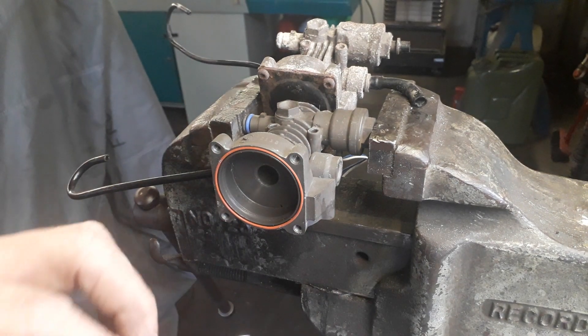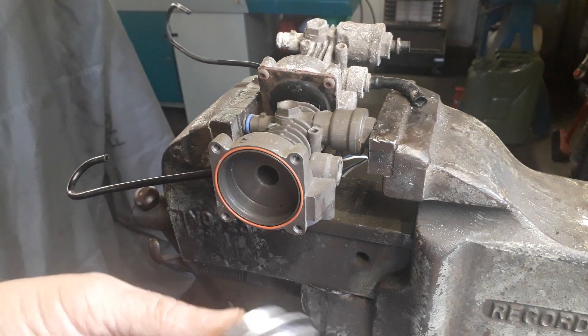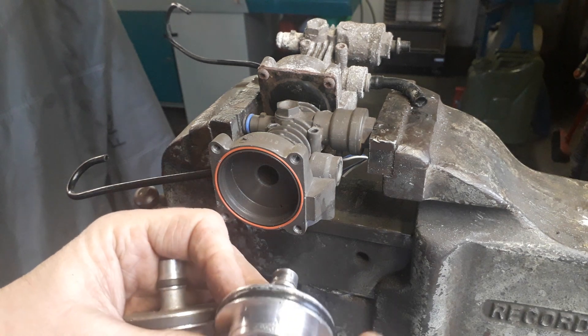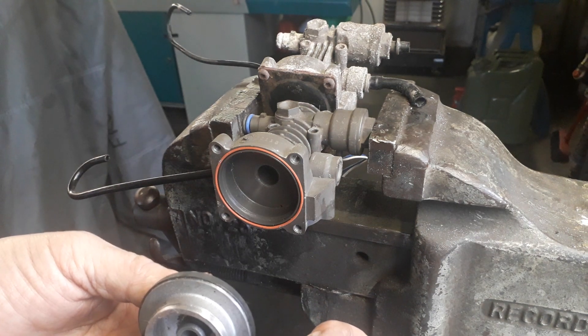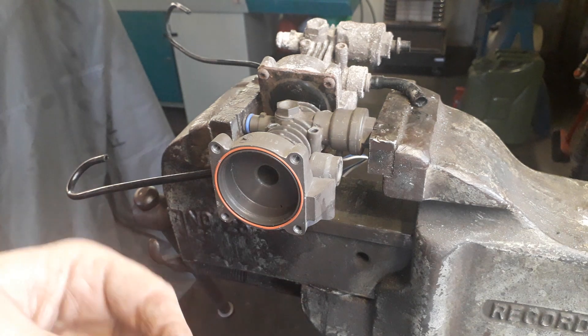The other shouldered type also has the seals on. Our seal kit fits both types, and we do recommend possibly changing the Dunlop exhaust valve for the exhaust valve with the seals on. Each type is interchangeable with either compressor, so just take note of that.